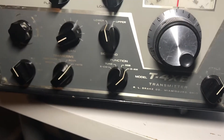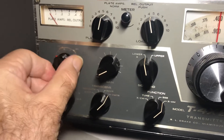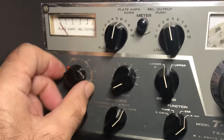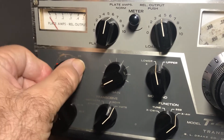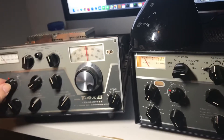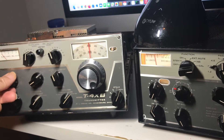What I found is when you're using the transmitter to control it, you better also make sure that the passband is lined up pretty well. Because the injection frequency is partly tuned by the passband here, I think. So you can see that it matters a lot on the received signal where the transmitter passband is.